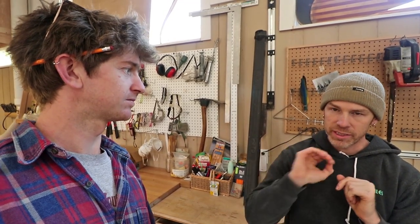The other reason I quite like the idea of the planer jig that you mentioned is that it'll allow us to gradually take the top off a piece. Using a router jig, you just have to set the level and then you're committed to that level, whereas with this jig you can gradually take off the top until you've got enough to put it through. You can shave it down just like you would with a planer or a jointer. You can just shave off a tiny amount each time and then see where you're at.